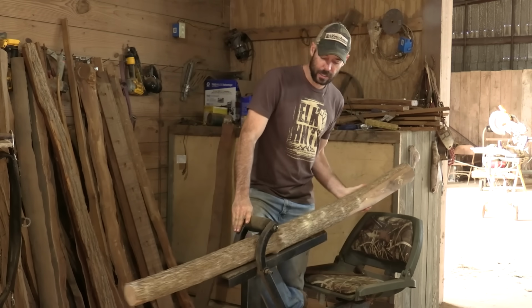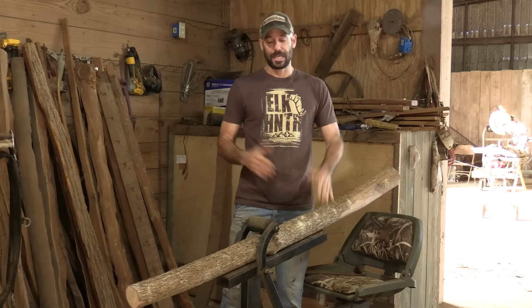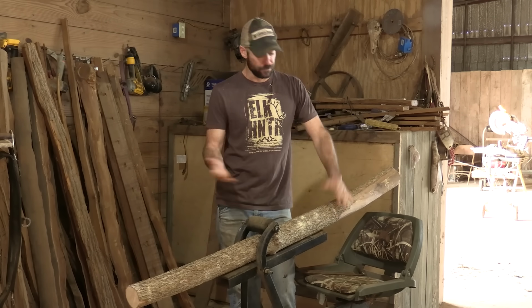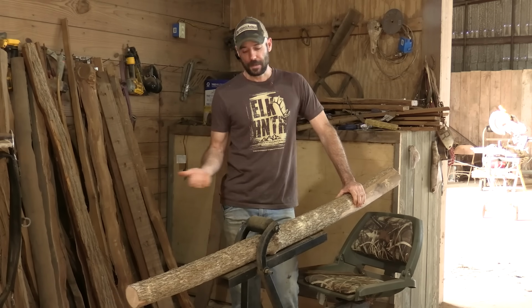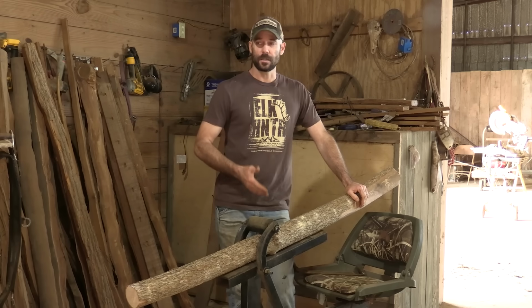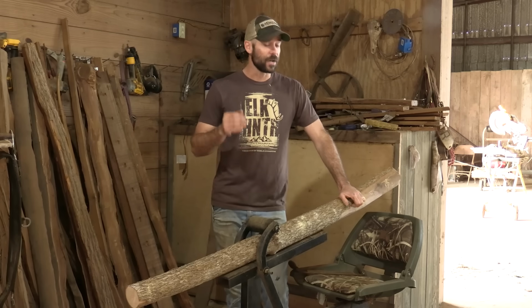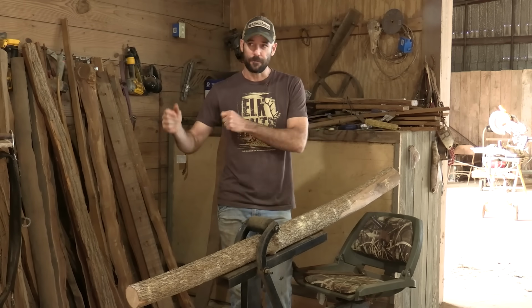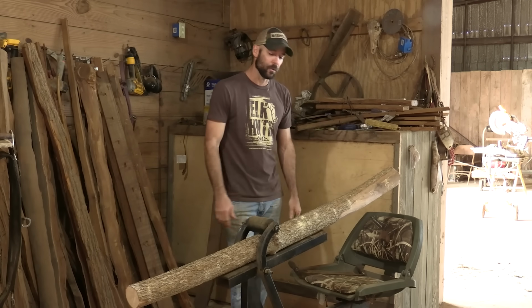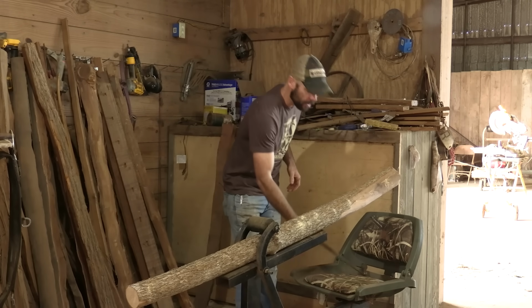Now this bow building bench that I got here, I'm going to get some questions on this. If you're going to get into bow building, you can get something very similar to this at stavemaster.com. They're great benches. But they're relatively expensive, and so if you're just going to be building a bow or two, you don't need this. All you need is a bench vise attached to a table, but if you're going to go that route, you need to make sure that it is very, very sturdy. Because if it's just mounted to a wooden bench or something, you will pull that thing all over your shop trying to get a bow built. And so throw a couple of sacks of Quikrete or something up there to make it heavy, and go to town.